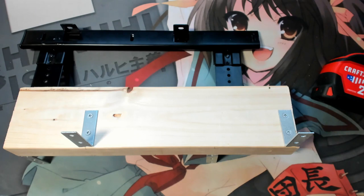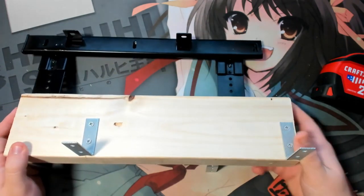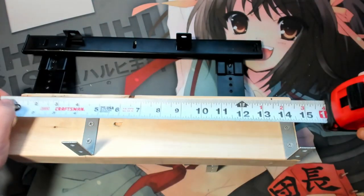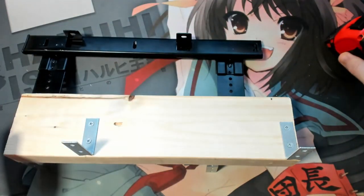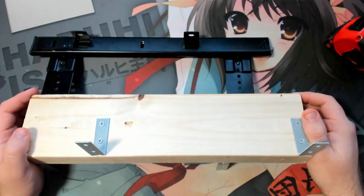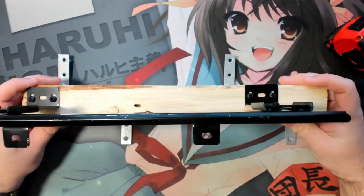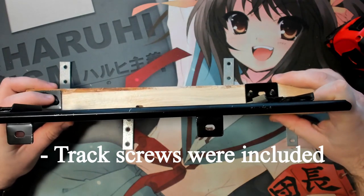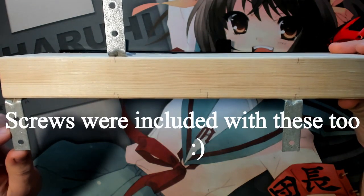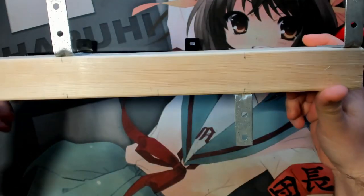The big question is how do I actually attach that huge shelf to the underside of the table? The answer is two pieces of 2x4 cut to 14 inches — coincidentally close to the length of the track, but it can be any size you need. The track itself is attached to the 2x4 on end with four screws. To attach the whole assembly to the table itself, I used four simple one-and-a-half inch L brackets, offset a bit to distribute the weight better.